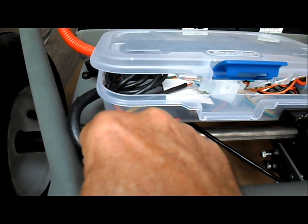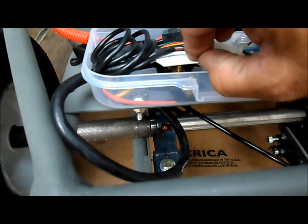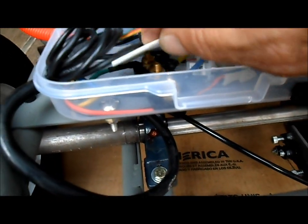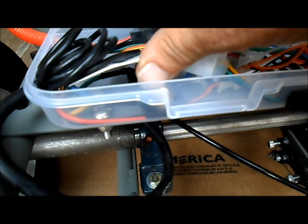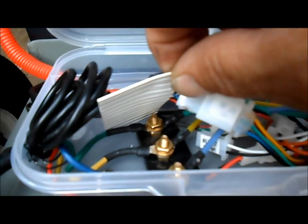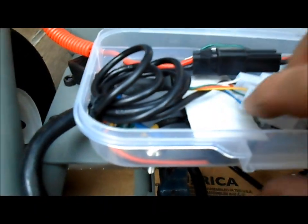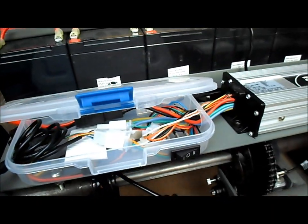Motor wires are warm. And then our blocker up here. You can see where it's been getting warm. And oh yeah, it's definitely... Yeah, them terminals are definitely hot. Blocker back in here to protect everything. Leave that open to cool off.